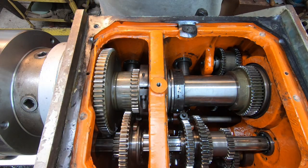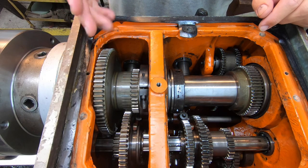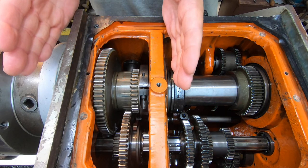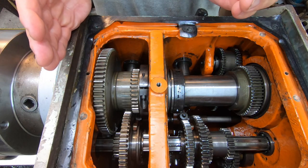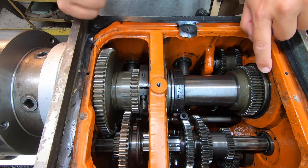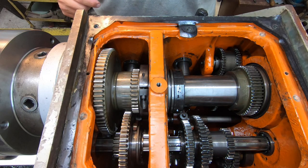I'm ready to start doing the adjustment. Looking through the manual again to fully understand the build of the spindle — we've got two tapered roller bearings. One is in front of the main gear, installed from this side, and then there's another tapered roller bearing on this end, which is the one we're adjusting, to take up the slack. The bearing in the back is actually a cylindrical roller bearing, so you don't have a tapered bearing in the back. I'm assuming the nut on the back side of the spindle just holds that bearing in place — you don't have to adjust that one.